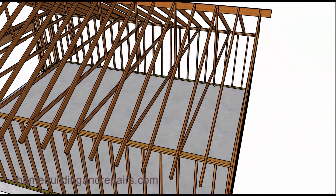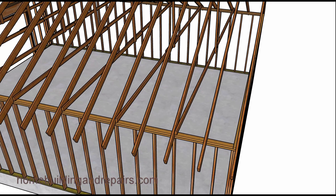It's not going to be uncommon to have a 2x4 that runs all the way across also. If you see something like this, it would be the same thing. If you have a 20-foot garage, they sell 20-foot lumber — a 20-foot 2x4 would be fine, and this would be a little less work than lapped boards for the framer.